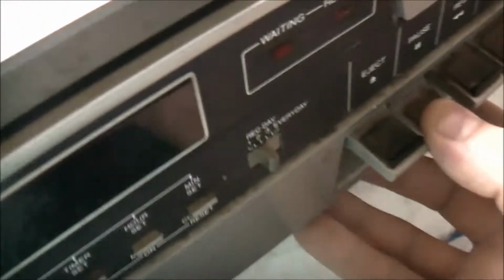We can't put a tape in it yet because I've got to clean up everything where the tape goes. It has to be cleaned, otherwise it's just going to wreck the tape. I've got an idler issue here. Yeah, the idler's just toast. It's not like a cassette player where you can override it with a little switch with your finger. You can't override these ones. You have to physically have a tape in them to play. So I can't test it until I put a tape in it, but I've got to check all the belts. I might take the top off and inspect the belts now.